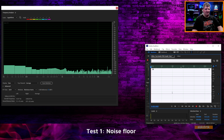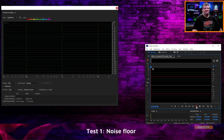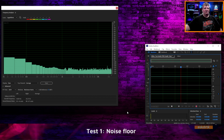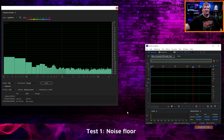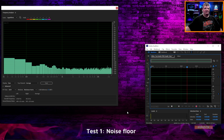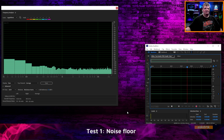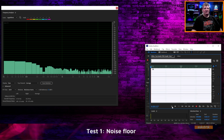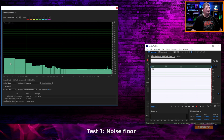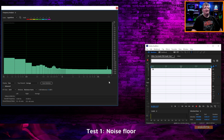Now I'm going to restart and increase the level on both the master control and the individual headphone output control — turning the individual headphone output all the way to maximum, and now the overall monitor control all the way to maximum as well. You can see there really were no major increases. For the average during that, the highest level was minus 89.94, and at 1K it was sitting around minus 119 again.